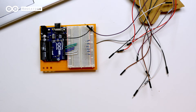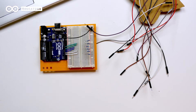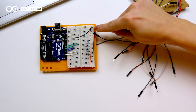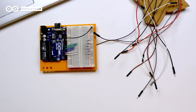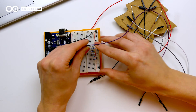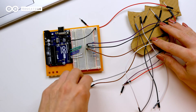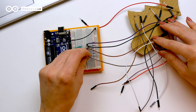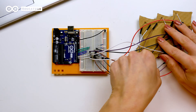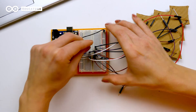I have connected six resistors and six short jumper wires here already. I use the digital pins 3 to 8 to connect my LEDs and once again I have always two with the same color. These resistors are all connected to the ground. Now I simply add the black, brown and grey wires to the ground and the other ones to digital pins. The white jumper wires on the tree are for the bottom LEDs so they connect to the two white ones for pin 3 and 4. Since I didn't have short purple and red ones I'm using greens and blues — as you know the color of the wires doesn't matter, it is just to make it easier for us to assemble everything correctly.